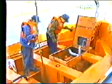Lifeboat engines only have fuel to operate for 24 hours. This fuel should be used to maneuver in heavy weather or rescue operations. The sea anchor, which keeps the boat end-on to the winds and sea, as well as the storm oil, which helps prevent the seas from breaking, should be used to create a more safe and comfortable riding boat.